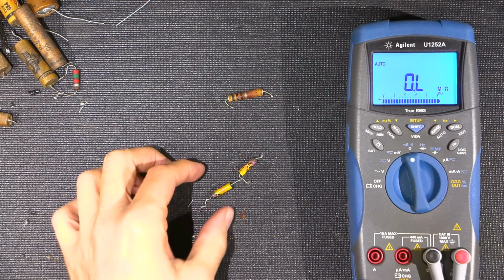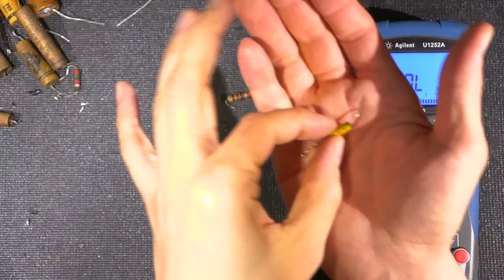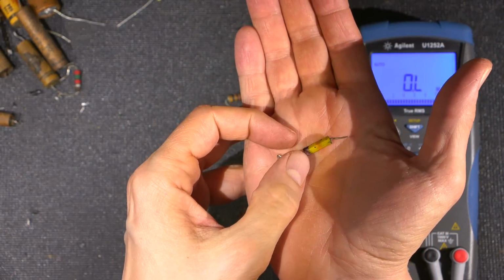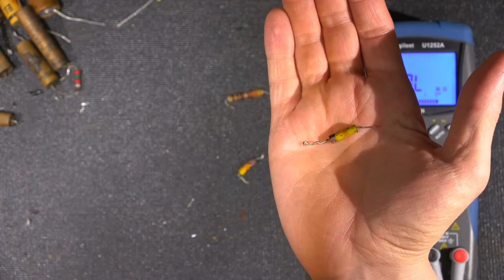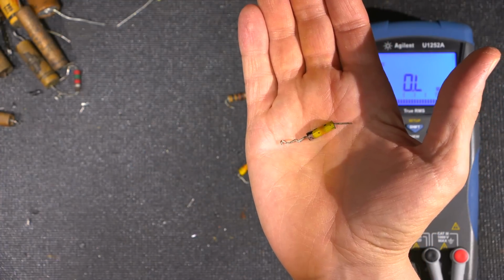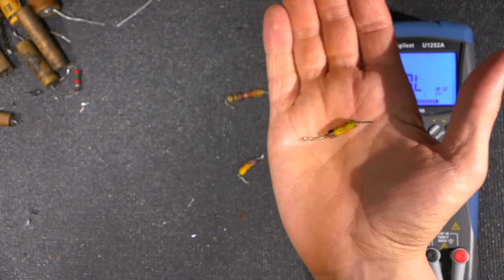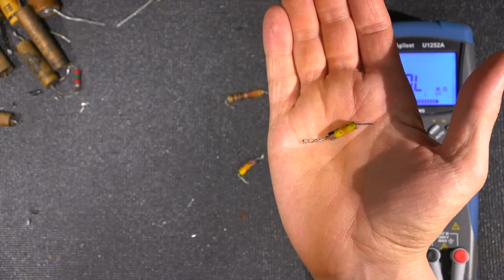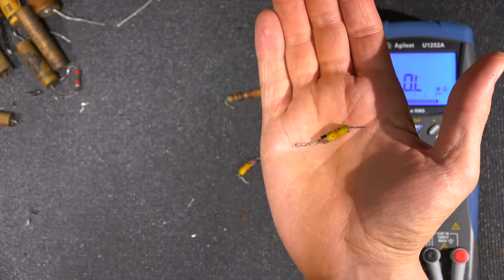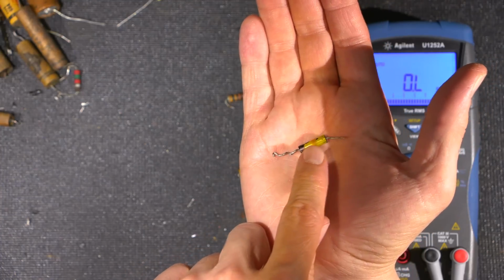For those of you that have never seen resistors like this, they read just the same as normal resistors, except their coding is a little bit different. If you can remember BED or BELL, you can very easily decode these resistors in the future. BED is very easy to remember: body and dot, or BELL as in body and line. So the body is the majority of the color.